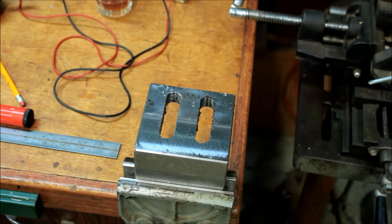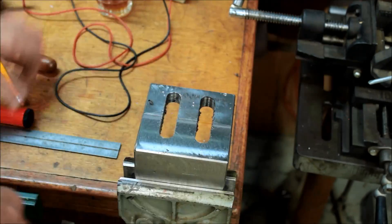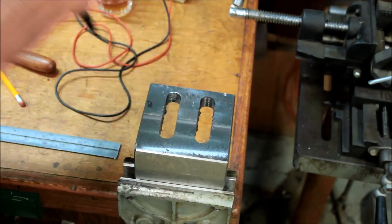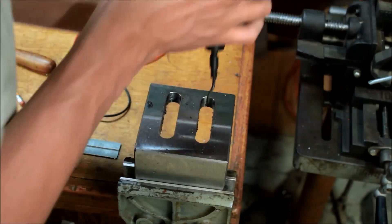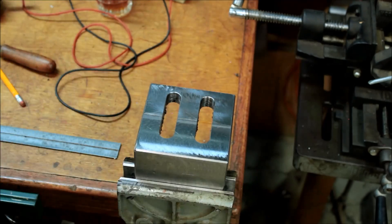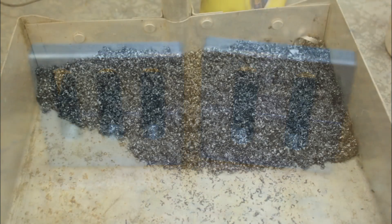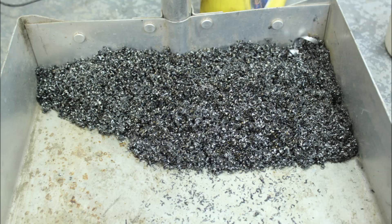Just a few steps left now. I've got to do a little bit of deburring — I needed to grab a knife deburring tool and a little triangular thing to get a spot out so I could run the rotary deburring tool around in a circle to cut the burr off. Getting it nice and smooth. And there are the two of them together, looking pretty decent. There's a pile of chips from just the five cuts.